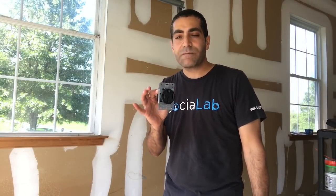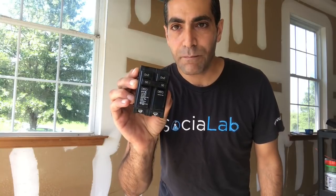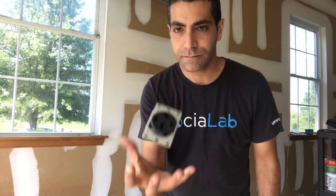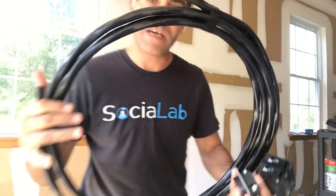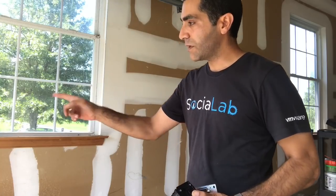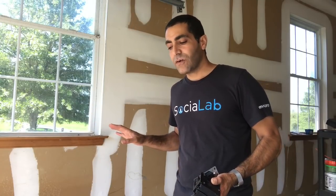Read through the instructions that Tesla provided - they're very specific about what components are needed. The first thing they ask for is a 50 amp breaker, a NEMA 14-50 outlet with the ground up rated for 50 amps or higher, and six gauge wire - three wire plus ground. I've got about 24 feet here. I'm only going about 20 feet from the breaker panel and we're going to put the outlet over here.